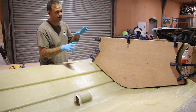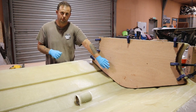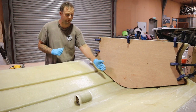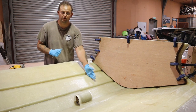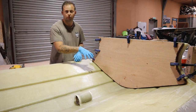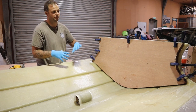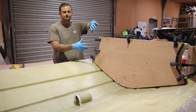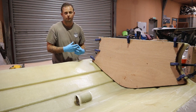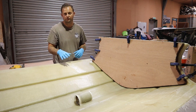But before that goes in, this needs to be finished because we're going to laminate from the top here down the face another 6 times on top of this face, okay, because we want to get a 50mm transom, and then again stage overlaps as we come in, so that'd be like layer 1, layer 2, layer 3, layer 4, layer 5, and that sort of concept, because then we know structurally all five layers have got contact with the hull. Again, it's all about building a strong foundation, because the engine's on the back of here. When it's hooked on, the engine's pushing the bottom where the prop is, that's where the torque's driving through, so it's going to work like a big lever, okay, so we need to make sure that this is nice and stiff going in.